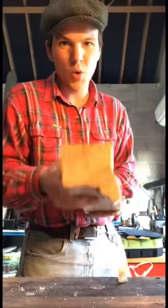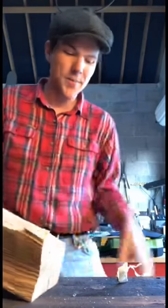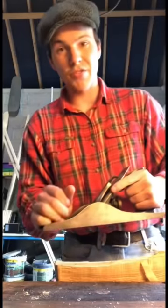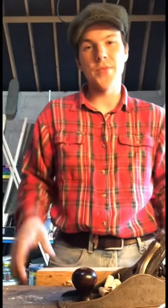Now that we have our mostly square piece of wood, we can just use an axe to hack off the extra bits on the side. After that, we can just throw it in our vise, then grab our old plane and do our final bit of planing. And just like that, we'd have our stock from an actual tree trunk down to a usable piece of wood.